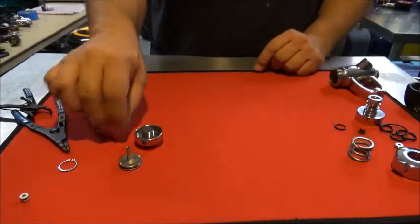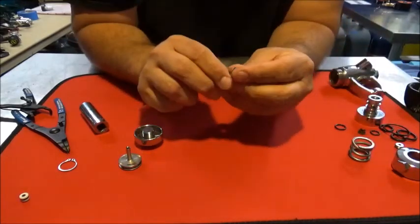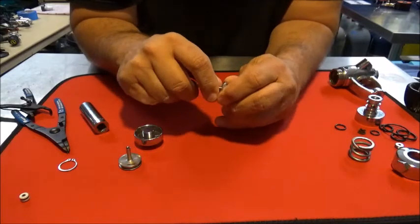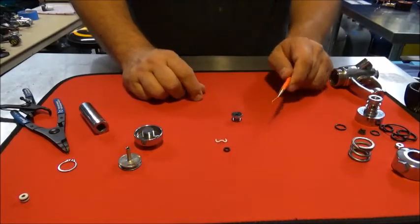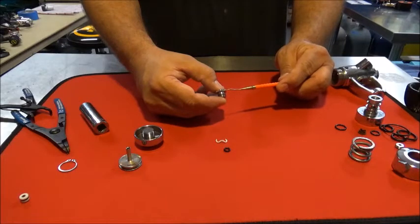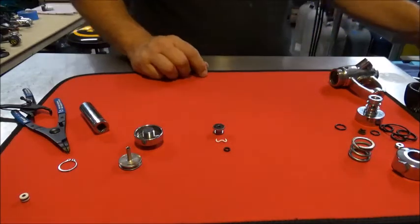The last piece I'm going to talk about before we get it cleaned up is the carrier that holds the O-rings for the piston. It's a little fiddly to get out and somewhat trickier to get back in. There is an O-ring and a Teflon backup washer. When you reassemble, remember that the Teflon washer goes in flat against the flat up here. The O-ring goes towards the lower threaded area. It is easier to put in the O-ring first and then put in the Teflon washer.